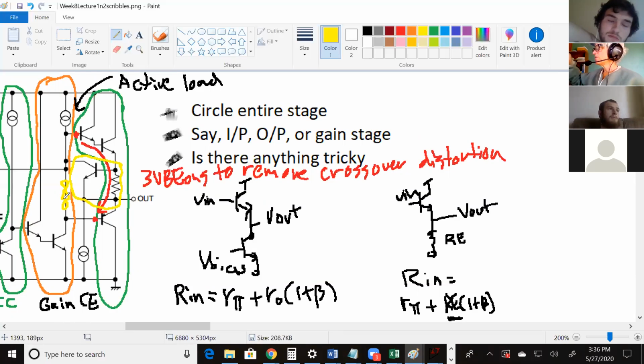It has to do with when you hook something up with feedback. Sometimes you get a problem where your circuit's unstable. Have you had 302? Okay. If you've had 302, then you've seen where things can oscillate when you hook something up with feedback. That capacitor is to keep it from oscillating. Oh, I see, that was privately to me. That's why it's probably mysterious to everybody else. Somebody asked what the cap was for. But yeah, it's to make it stable once you hook it up with feedback. If you're not using feedback, you don't need that capacitor.